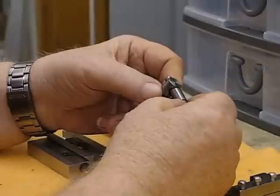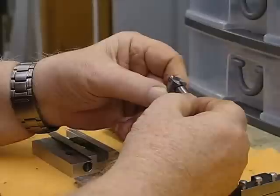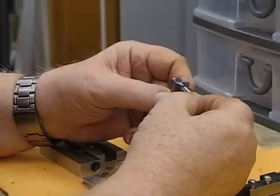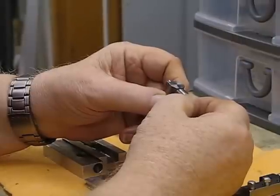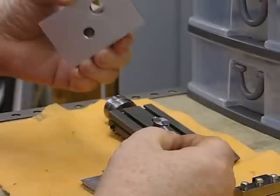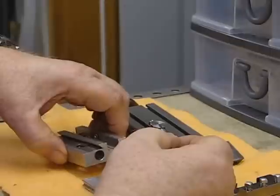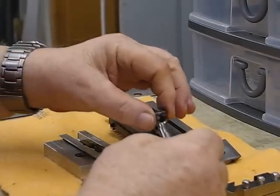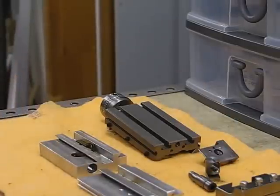What the eccentric does is it goes into the hole — you can see it's all loose in there — but as you turn it around it pulls the floating plug or pin up, and in pulling it up it pulls the base of the top slide down tight onto the cross slide.